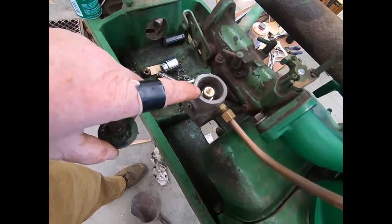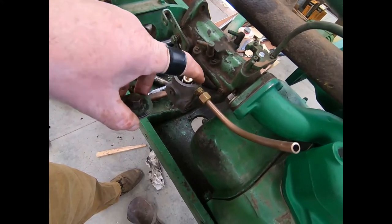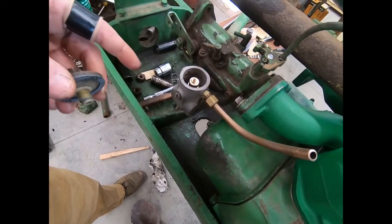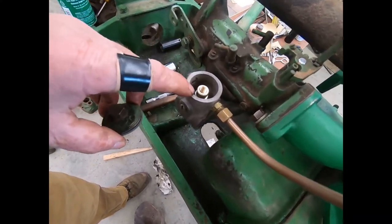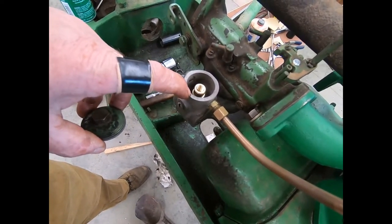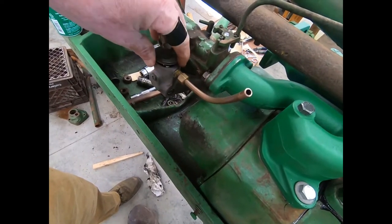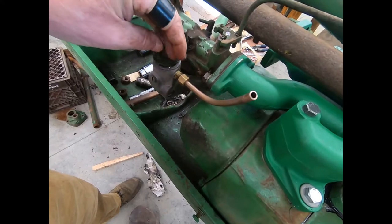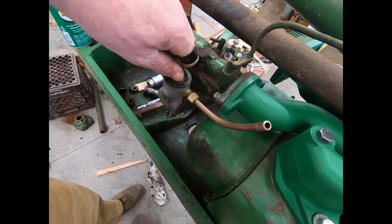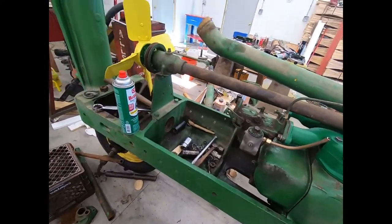And I am going to pull this off. I'm going to take things apart and put this in the milling machine. I'm going to indicate flat on this because that's really the best area to register flat on. Then I'm going to go on down and kiss that with a 3/4 inch end mill. Take probably 10 thousandths off, net. Enough so it's good and smooth so I know it'll seal. And then we might have to bend the rod to the float a little bit.